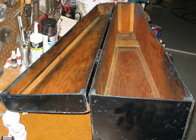As can be seen in this other view of the old case, the structure is really primarily in the plywood, but it is helped and supported along the edges by the thin strips of wood. But still, this is a very flexible structure, and it's not really any stronger than it would be if you just had pieces of wood flopping around in the breeze. The structure that's there from those thin ribs doesn't really make the case any stiffer.